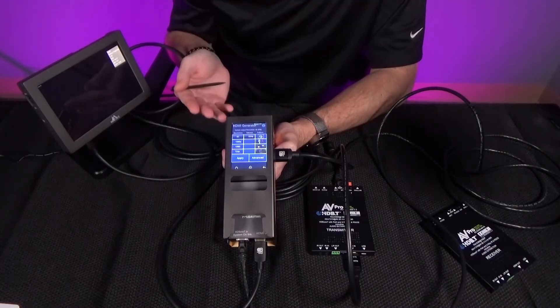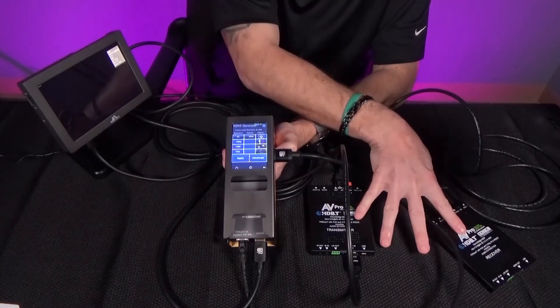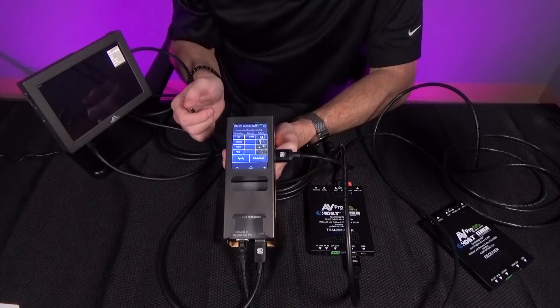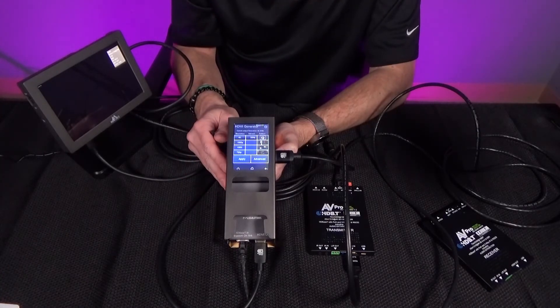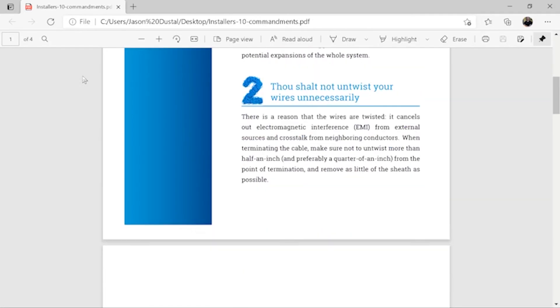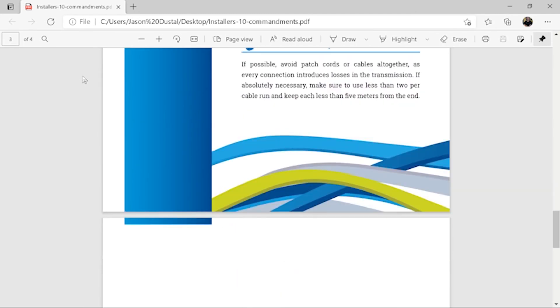For the rest of the system, you would simply repeat what we've just done — testing the rest of the lines, the rest of the HDMI cables, and any other transmitters or extenders in the system. Once everything has been tested and documented, you now know the system is going to work properly. The documentation will give you and your customer confidence that all the cables are operating correctly and passing the signals that you'd like them to pass. Thank you for watching this training module on the MS Test Pro. Keep in mind that the MS Test Pro is designed to tell you what's wrong with the system, not necessarily how to fix it — that comes with knowledge and experience. One document you can always refer to is the HDBaseT Ten Commandments, with helpful and simple tips for setting up, installing, and troubleshooting any AV system.